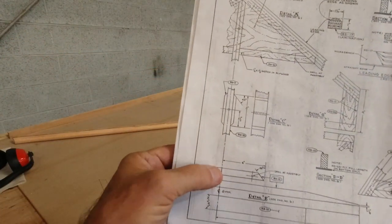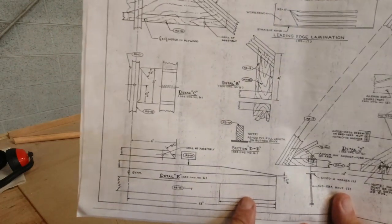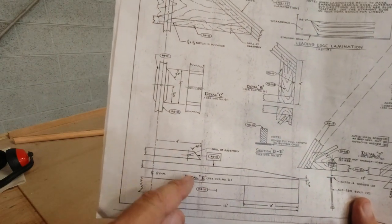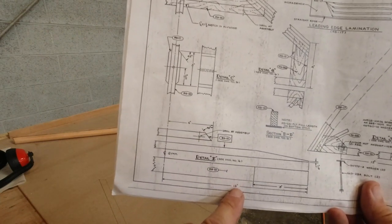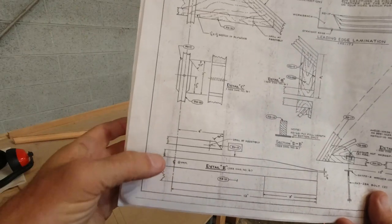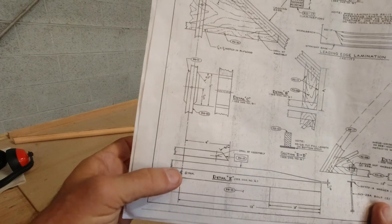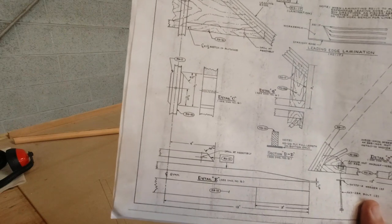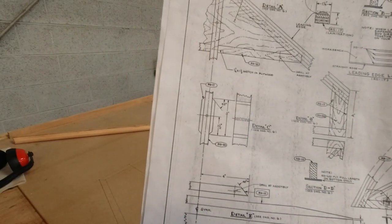One of them looks like it's 8 inches long. The other one looks like it's 26 inches long. This one gets a taper on the end for the last 5 inches on either side. So we'll get these two pieces cut. One at 8, one at 23. I'm just doubling these because it's taking us to the center line. So, one at 8, one at 23, and then we'll work on tapering the tips on that, and then we'll be able to figure out what this center spar size is.